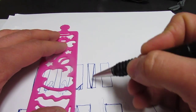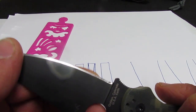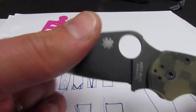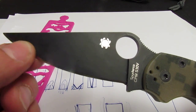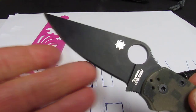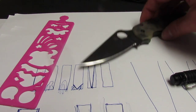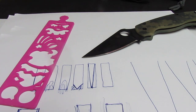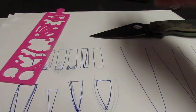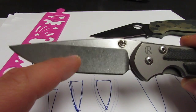Because of course that's going to cut well. That's almost like you took this, made this bevel a little larger, knocked off the shoulders, but at heart, most of this would stay DLC coated, right? Because it would be primarily a flat grind with a convex edge. And I couldn't argue that. That would be a nice, strong using edge with enough meat behind it, yet still be very thin, and all the transitions would come up and be very smooth. So maybe that's where I'm even misunderstanding that, because I'm not really poo-pooing on convex. Obviously, my favorite is a convex edge on my hollow grind.